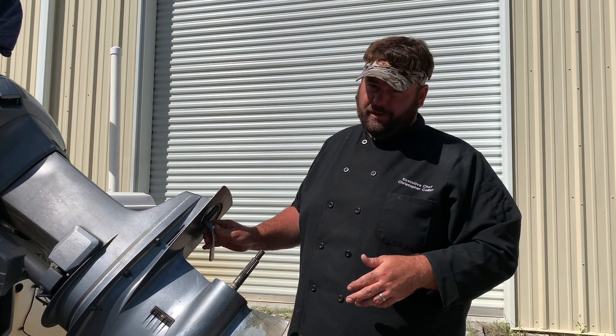There's a 14 millimeter, 9/16 bolt right here. When I take them out I usually clean them up and grease them before putting them back in — helps with oxidation in salt water. We remove these three here, there are three on the other side, and one up underneath. A lot of people don't realize that top bolt is there and start beating the unit to get it apart, unbeknownst to them there's another bolt. Make sure you keep track of your bolts.